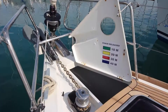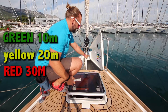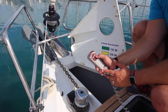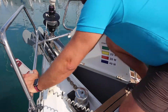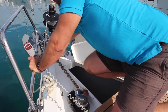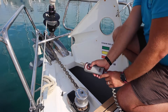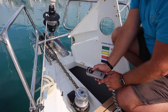On the anchor chain we have colors marking how much chain you have: green is for 10 meters, yellow for 20 meters, red for 30 meters, and blue for 40 meters. There is 60 meters of chain on board Nelly. To let the anchor out, hold the down button slowly. If you get to the threshold point, you need to help the anchor across. Once gravity is holding the anchor, lower very slowly so that the anchor does not swing and hit the bow of the boat causing damage.